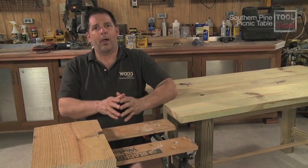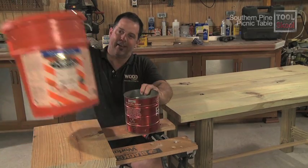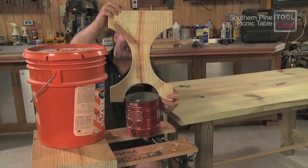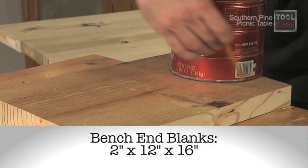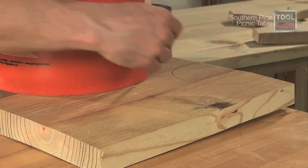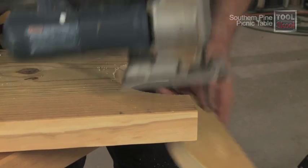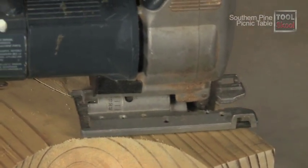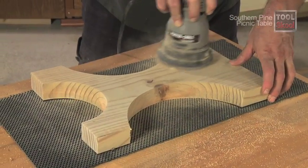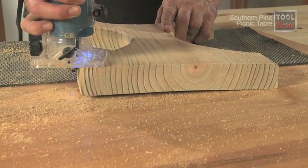No table is any good without a place to sit. The plans give several options for the bench design, but I went for something a little more complicated and upscale. You may not have the tools, but if you have a jigsaw and an orbital sander, you can create these bench ends. Use a coffee can to draw the lower curve on the bench blank — a 2x12 cut to 16 inches long. A five-gallon paint bucket is used for the curves going up each side. Center up the curve and go for it. Use a jigsaw to cut the rough shape, an orbital sander to remove surface imperfections and saw marks, then use the round-over bit to soften those edges.